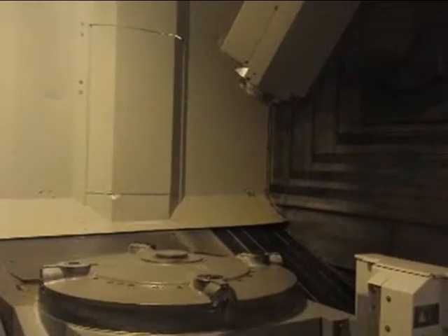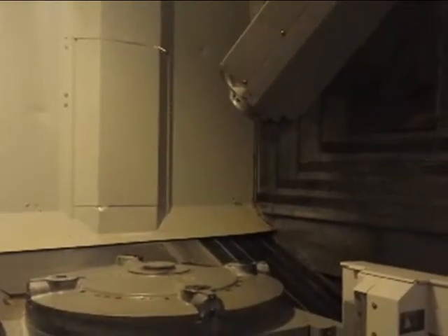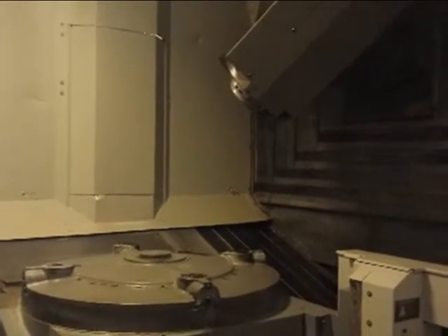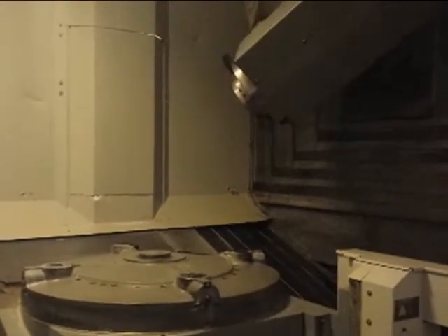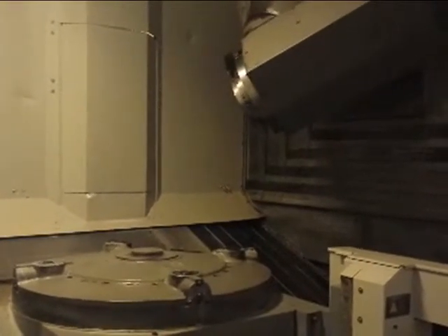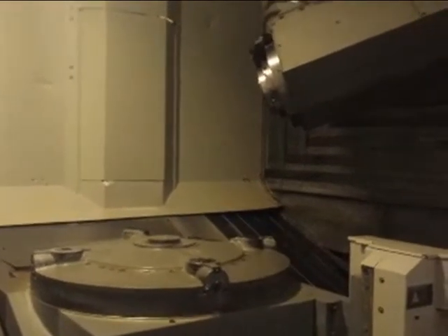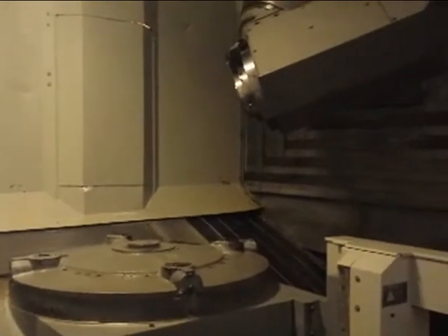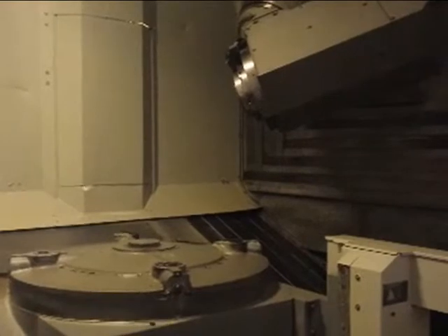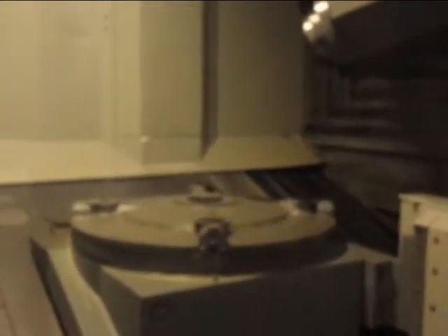It's a full B-axis — it goes 187 degrees. It's a 5-axis milling and turning machine, HSK 100. It's a mill-turn and full 5-axis machine. The table is nice and whisper quiet, and then we move the head again. The head is 187 degrees simultaneous, and the table does milling and turning in one machine.